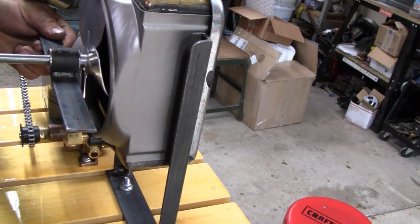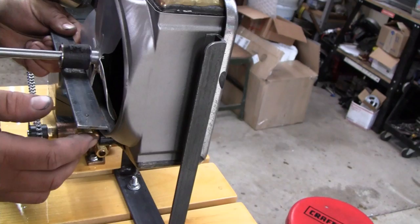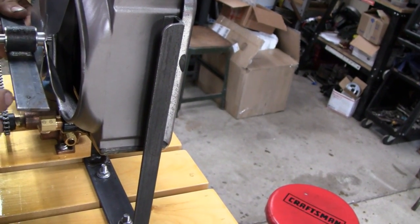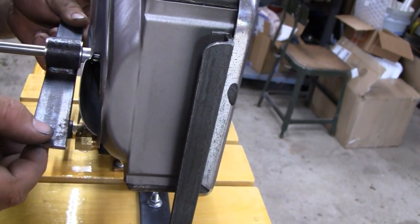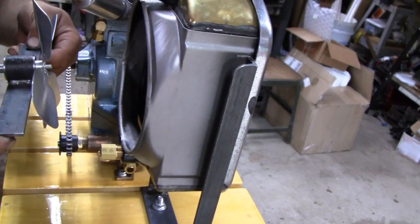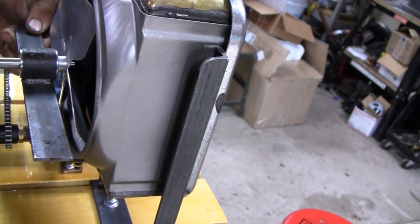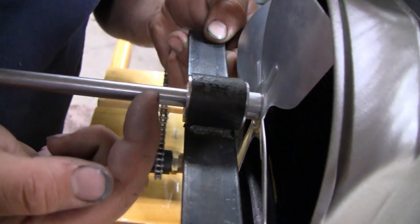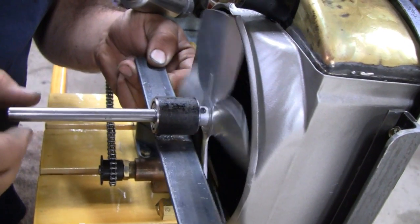So it's going to sit right in there and rotate in that direction. We're going to weld on two flat plates in this orientation coming out from the two uprights, and then we'll oblong the holes — in this direction on this plate and in that direction on the other plate — so we've got in-and-out and side-to-side movement. There's the shaft, and the sprocket's going to be about right there, so the sprocket's not going to be hanging out.